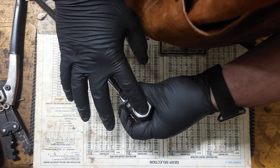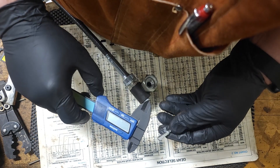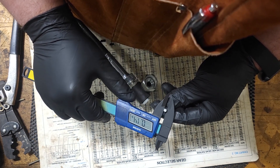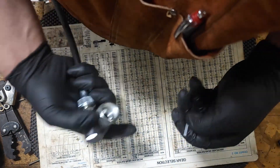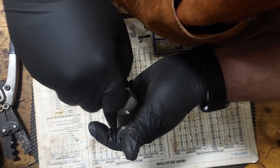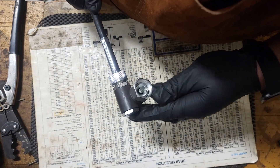So now what we need to do is give this end a tip. So what we have here is our adapter with a 150 tip. Let's check the calipers again, just to make sure. Yeah, that's a 150. So what we do is take that key down, find the right slot, push it in, and that's it. Normally these can be done by hand. This one still can, but because it's nine feet long, it does take a little bit of oomph to it. But when the transmission is turning it, it shouldn't have a problem at all.